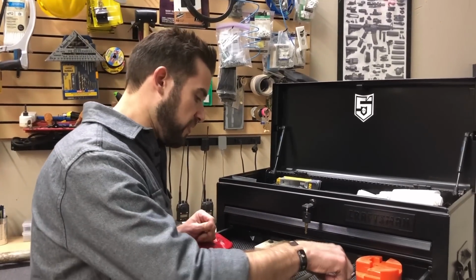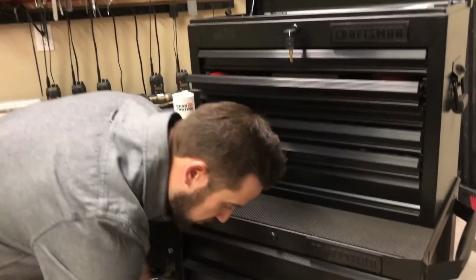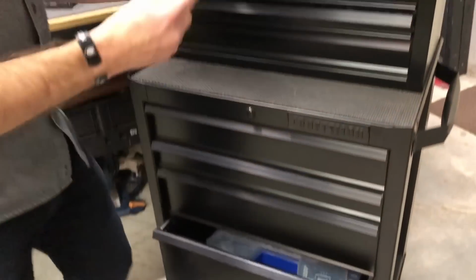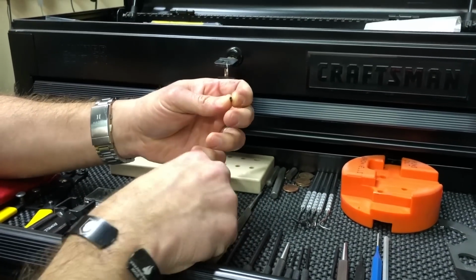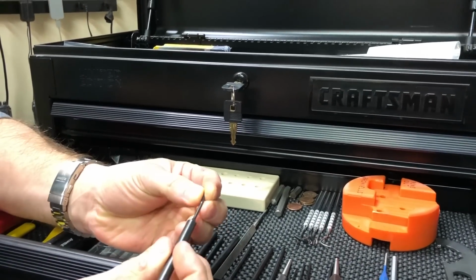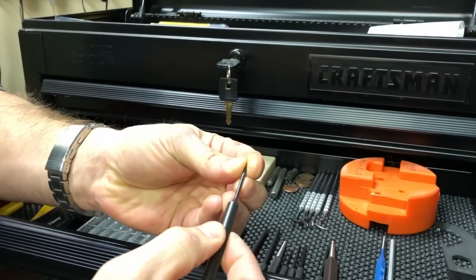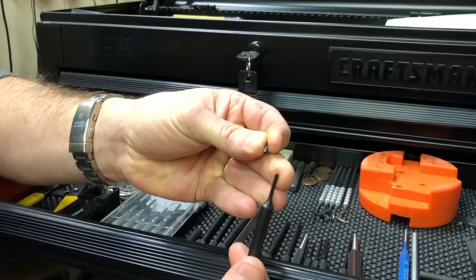So what's great about these is that when you're looking at a lower parts kit, you guys have probably all seen my obsessive compulsive organization on the roll pins. So, let's just take a bolt catch roll pin, for example. When you're looking at a bolt catch roll pin and you're trying to put this into the bolt catch location, you need a specific tool like this so that when you're hammering in the roll pin, you can see the nipple that's on the tip of that roll pin punch, and this is a Brownell's tool as well. So it fits right into that roll pin, so it gives it some grip instead of just hammering a flat punch onto that surface, which is completely doable. You can do that as well, but this just gives you kind of an edge up on that.